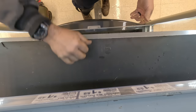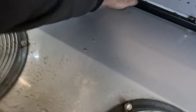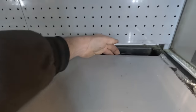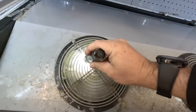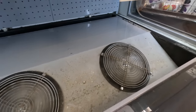I suppose you can flip it upside down and flip it in there like that. Feeling in the back — there is a temperature sensor right there, another temperature sensor right there. We've got two temperature sensors. The coil is not frozen, probably slightly dirty — not horrid. So we probably got a refrigeration issue down here on the bottom.